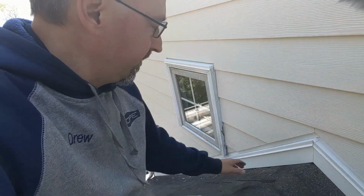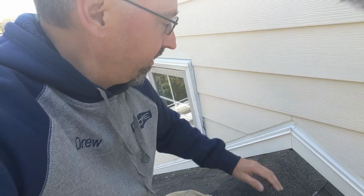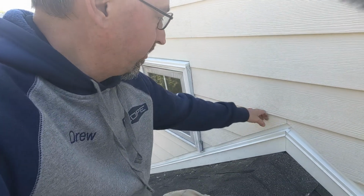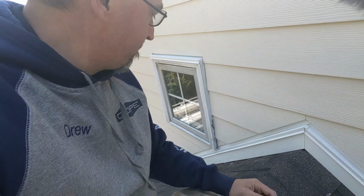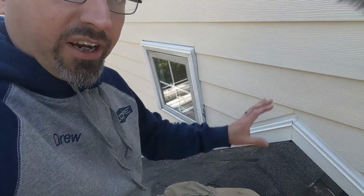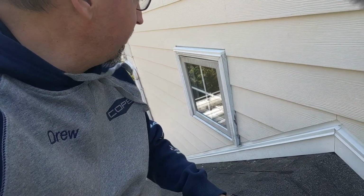And so with this system, you've got plastic PVC trim, one of those brands down here, protecting this product. And then we've also left another half or three-quarter inch gap there all the way down, and that's going to protect the product from the water, but yet allow the drainage that we need to allow.